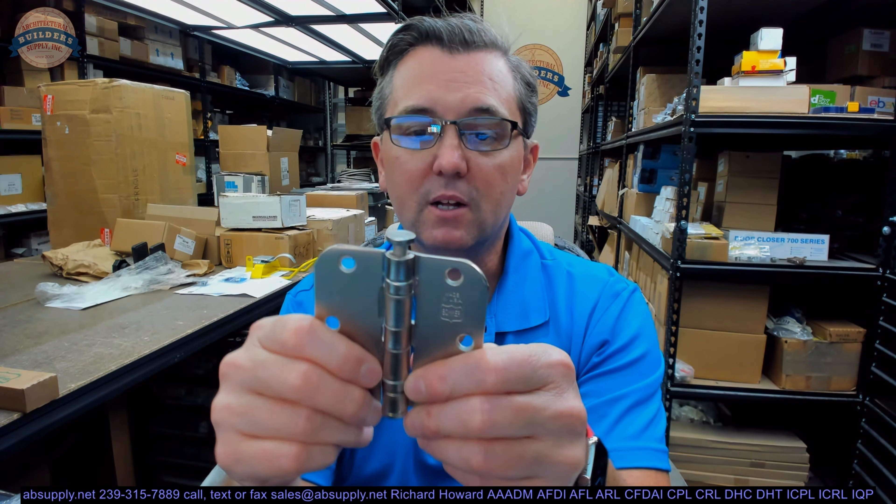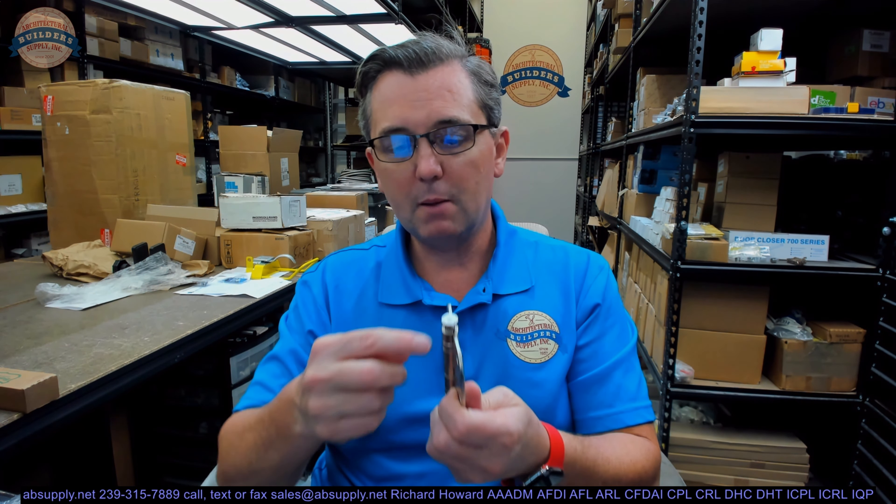This is a commercial-grade hinge because the client wanted something more substantial. In the home, the most-used doors are the front door, mudroom door, side door, bedroom doors, bathroom doors, linen closet — and those basement doors, mudroom doors, and exterior doors are getting used all the time. The client wants to route his hinge prep deeper because he knows that in 5, 10, or 20 years there will be substantial wear on those plain-bearing residential weight hinges.